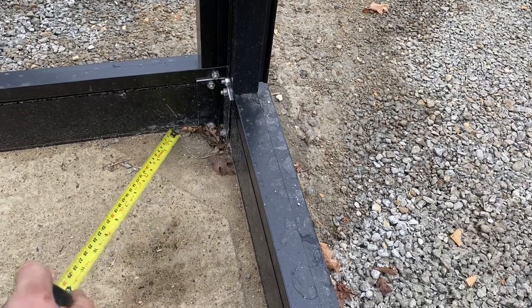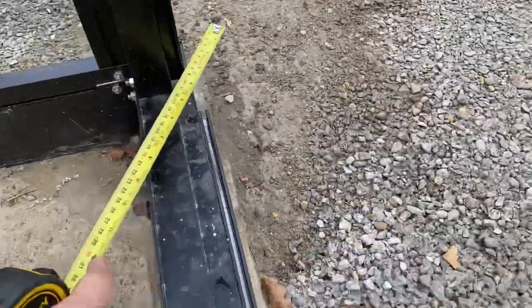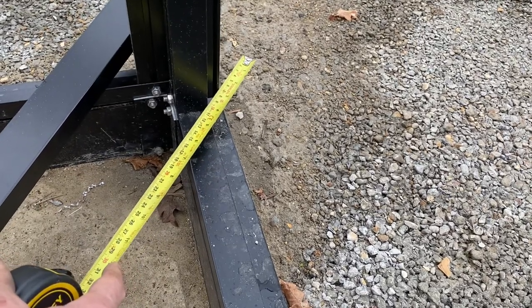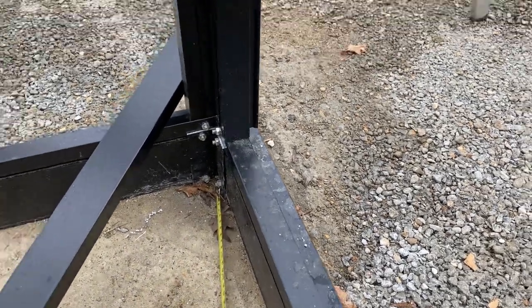But they don't tell you how much concrete to miss out. The concrete needs to come to about here, and if we measure from the outside corner of the metal, you need 14 centimetres to about this position, and then it leaves enough clearance. That's the first thing.